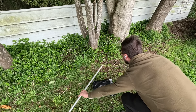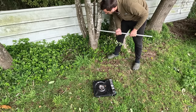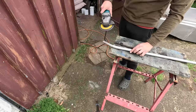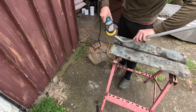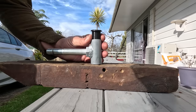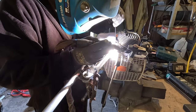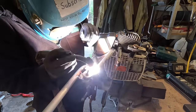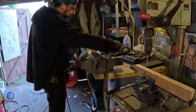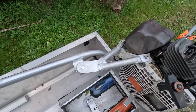I heat the pipe to bend it with my bending tree in small increments so as not to deform the pipe. I grind it to shape. My bushes are made, so I put them in. Then I tack all the handle parts together and weld them off. Here we go, that's all put together. This is all aluminium, I've just wire wheeled it.